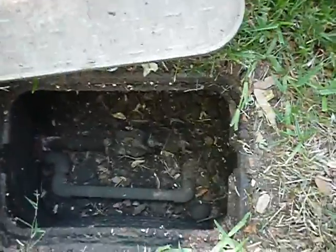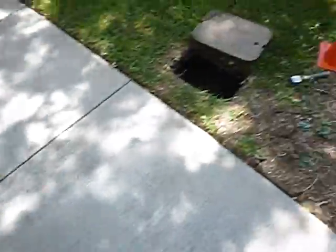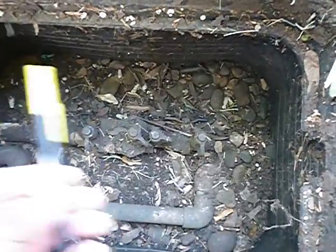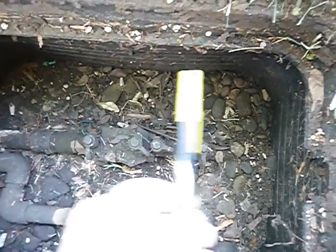This is the check valve backflow prevention for the lawn sprinkler system. It's not supposed to be in the parkway — you don't really own the parkway — it's supposed to be on this side of the sidewalk. We do not have a main shutoff valve going to the sprinkler system; we do have isolation valves, but they're buried, old, and rusty — they'll probably break if you use them. This irrigation box should have been excavated — you should have three inches below these valves so you can wrap your hand around them to service them, and the box should be lined with gravel.